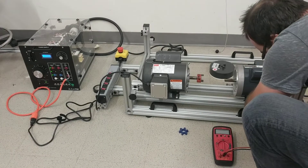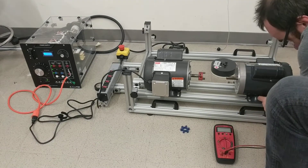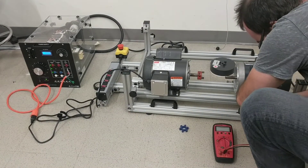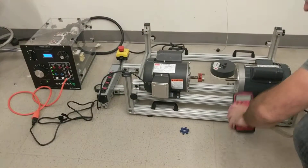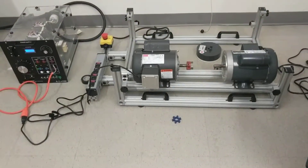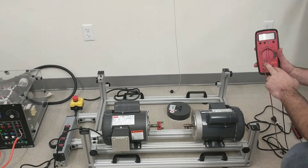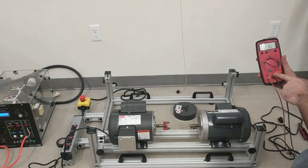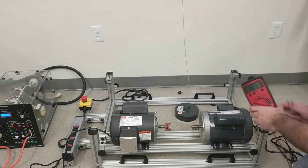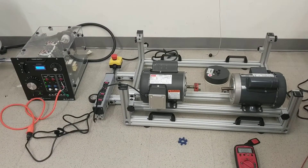What I'm going to do is show you something really quickly. Have you used multimeters in your electronics class? Whenever we measure current, we use the 10A and the COM terminals. The other two are for voltage. So I'm going to crank this on AC current. Whenever we're measuring current, the multimeter is in the circuit, so the current actually flows through it.